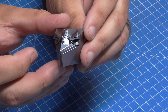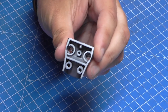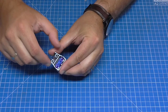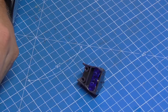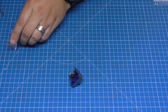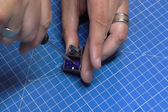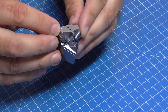Bringing up the face — it's got a big cavity in the back where we'll put the eyepiece. The blue lens goes over the top, and to hold that in we use an AP screw. All screws come in labeled bags. Remember: if the letter at the end ends in P, you're screwing into plastic; if it ends in M, you're screwing into metal.